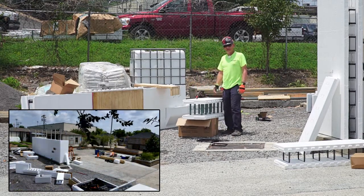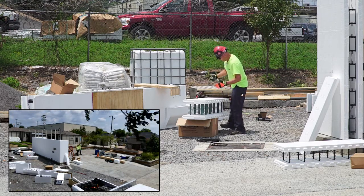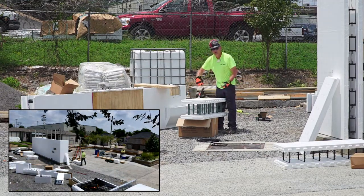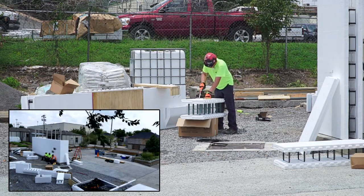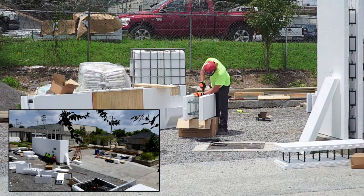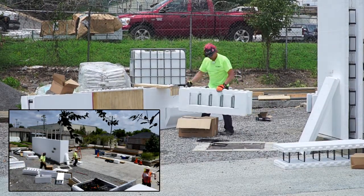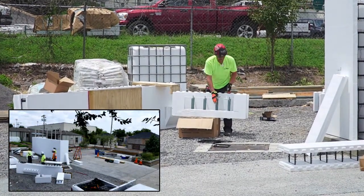It's also 100 degrees out and humid, and I'm not from this weather. So what I did is I marked down 11 and a quarter — 2 by 12, that's what we had; we didn't have any plywood, so that's what we're going to use. I took this chunk out, which leaves us a curb block that has these furring strips right in the dead center of the block.